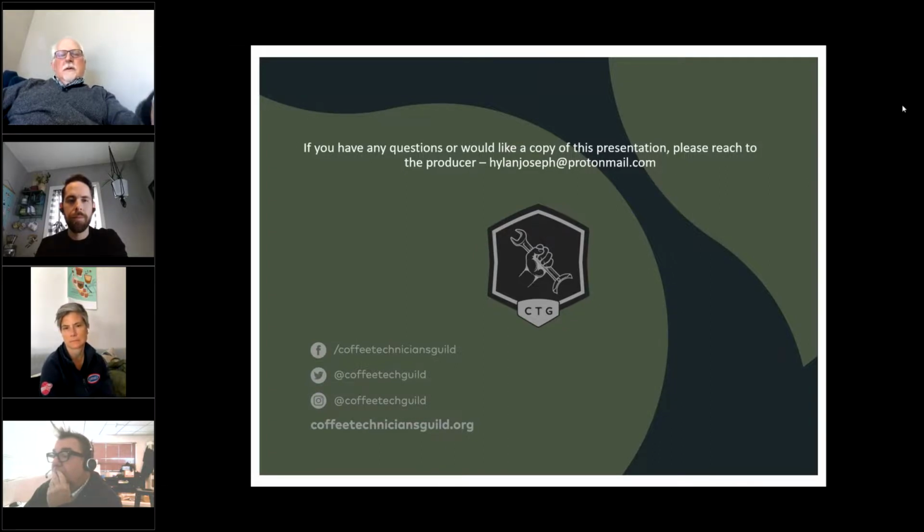So it's possible that you can have a bad connection in a common leg and then lose the common everywhere after that. So if you have multiple components that are down, then you might have a common wire issue. If you only have one component that's not working, then you can trace that back to the box and that one component that's actually being switched by the box.